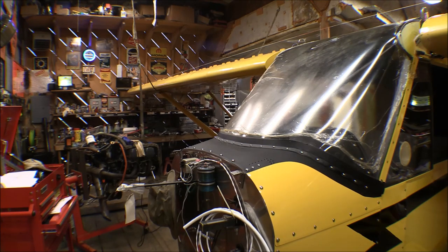They're both exactly the same. I got the struts all on and put the bolts and nuts in on the wing spars for the rear struts — they need to be torqued down yet, but they're in. I put the bolts in on the front struts too, but there's still a tie-down ring that goes on there. I messed up — the tie-down ring should have gone on first before I put the bolts in, so I'll have to redo that.